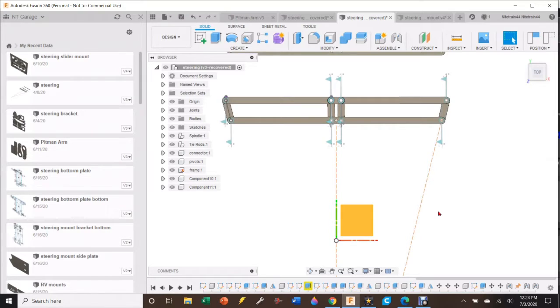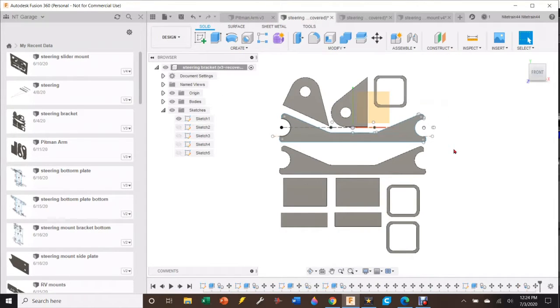One of the things I've really enjoyed about this project is the opportunity to learn CAD better — I'm using Fusion 360. I've mocked up the steering to figure out the Ackermann angle, and what I found is that the difference between the two lines is about 14 degrees. As I go into building the steering shuttle, that translates to the steering rods needing to sit about 1.4 inches outside the lower mounts of the suspension. That makes this bar from center to center about 9.4 inches — these are the plates I'll weld onto the shuttle to hold the rod end mounts for the steering.